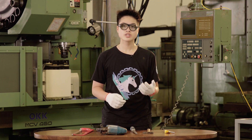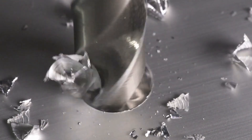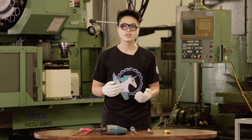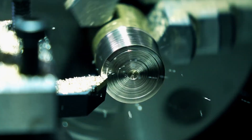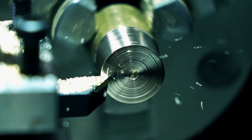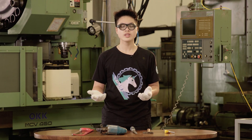The mill is great for drilling accurately, cutting sheet metals and wood, and making grooves — it's generally great for creating many parts of a robot. Yet there are some limitations: it is terrible at doing anything that is not along one of its XYZ axes, so any curved or angled hole is basically impossible. Also, the accuracy of this machine is highly dependent on the tool bit you're using. Another common machine is the lathe, which is extraordinary at cutting cylindrical things and axles with exceptional accuracy — but that is really the only thing you can do with it.